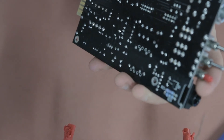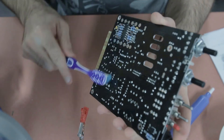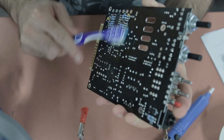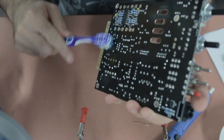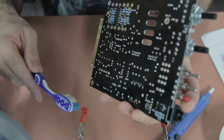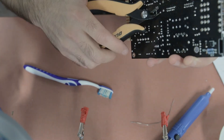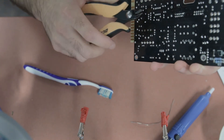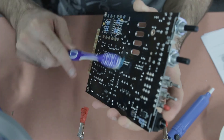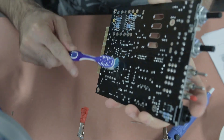Once that's all done, it's time to do a visual check of the board. First I gave the board a nice brush to clean off any loose solder and flux from the PCB. Then do a visual check to make sure you don't have any missing components, and check the boxes to make sure nothing's been left behind. When everything looks good, we're ready to do our first stage of testing.